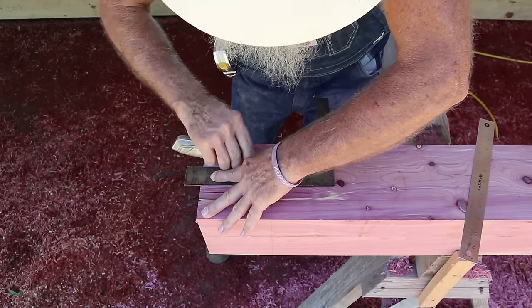I'm going to make two passes with the skill saw — one right up close to the line, then come out a little ways and make another cut — so that when I'm cutting with a chainsaw I won't have a tendency to go past my line. I'll hold my chainsaw back a little bit from that point and cut this piece out. This is the top of the post — the only difference from the bottom is the tenon is only four inches long. I'm measuring from the shoulder of the tenon at the bottom, coming up seven feet and eleven inches.